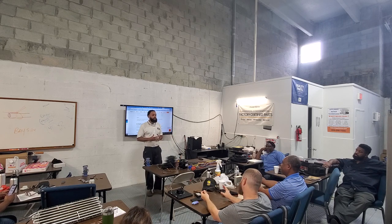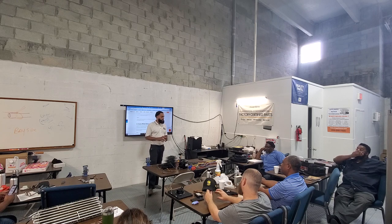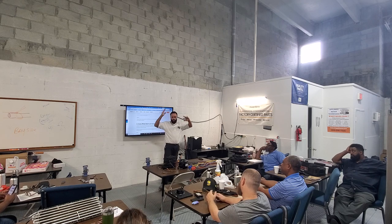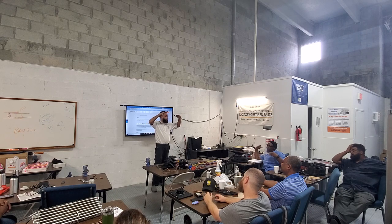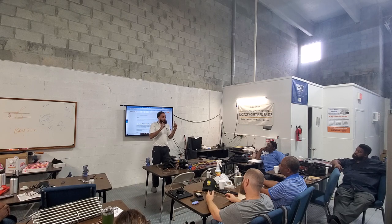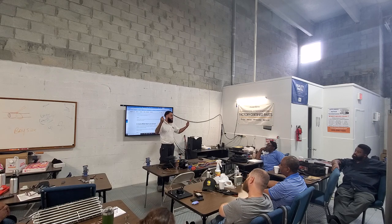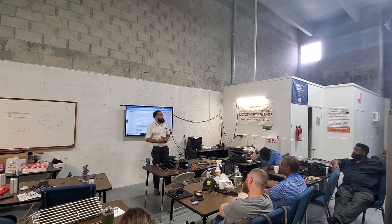It's a bad thing. It's a very bad thing. At that point, you know you have an inefficient compressor. With the unit off, you'll get PSI readings of about 55, 65, somewhere up in there. And when you turn on the unit, your manifold gauges will start to separate. One will begin to go low, and one will begin to go high. If it doesn't do that, then probably that piston isn't working, the valve is bad. Mechanically, it's failing to circulate freon throughout the unit.